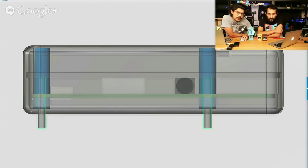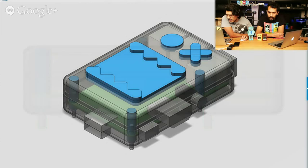And then this is what the side profile looks like. So you can see the cylinder that's highlighted. That's what I'm going to use as the, let's call it, the cutter, right? It's going to cut the hole so that a machine screw can screw through the bottom, through the PCB and into the standoffs on the second part, making a nice little Raspberry Pi sandwich.